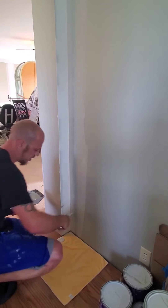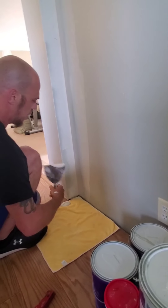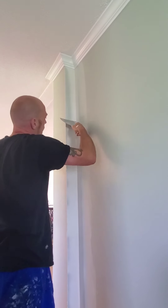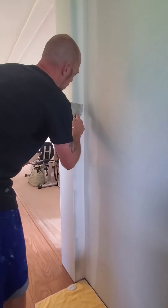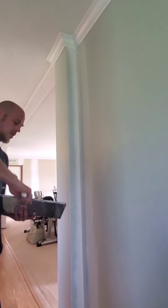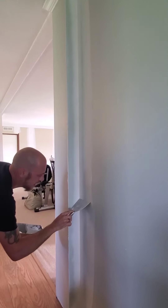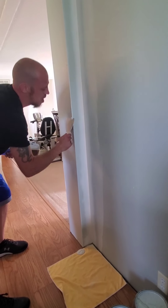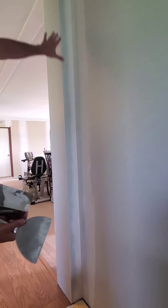This wall here is a little bit different — there's no flaring it out wide because the wall is only so big. Just like on the other side, start at the top or bottom. Angle your knife in towards that seam. We're shoving mud over to the other side — no big deal, it's going to happen. You have to finish one or the other first. Now that this side is clean, go back to the corner side and ever so slightly pull down to get that little bit of edge that worked its way over. Take your knife and run it right up this wall to get those little crumbs that fell over that corner.